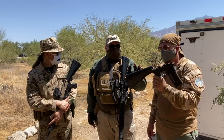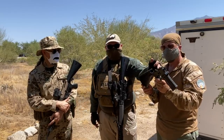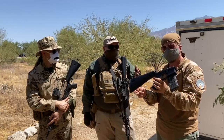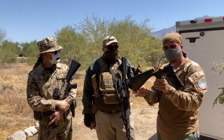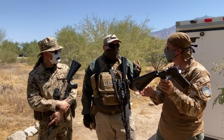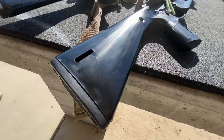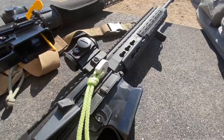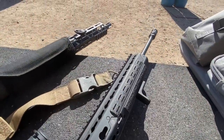So you might have heard me mention before that the fire control pinholes weren't fully formed in the mold yet because we wanted to make sure we calculated for shrink rate. They look like they're right on where they need to be. They're undersized. So to finish those out in the selector holes, we used an 80% jig. And everything looked like it lined up properly. So we're fairly confident of where the pinholes need to be for actual production. That'll be a revision we make in the mold.